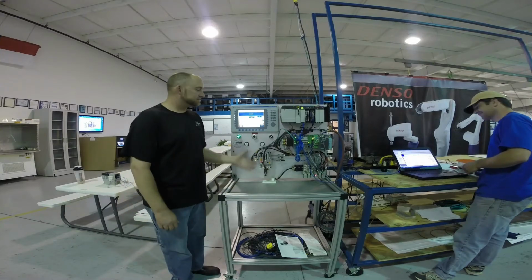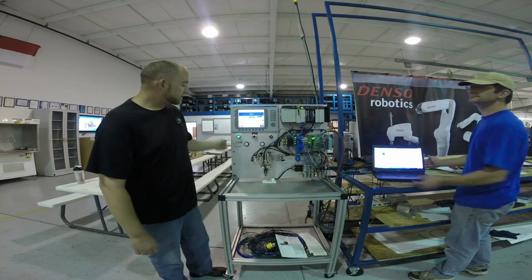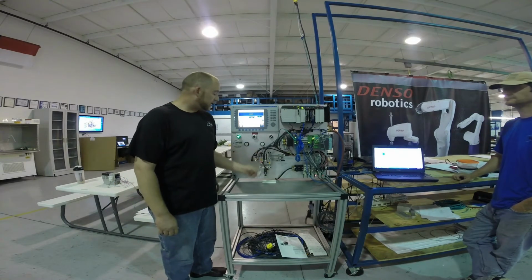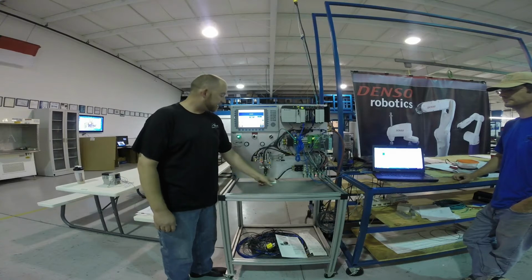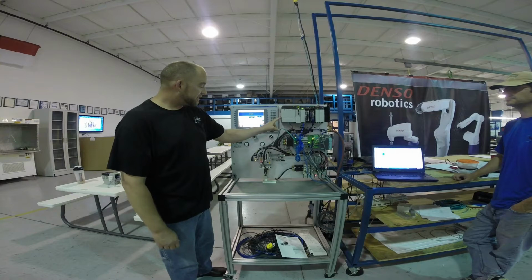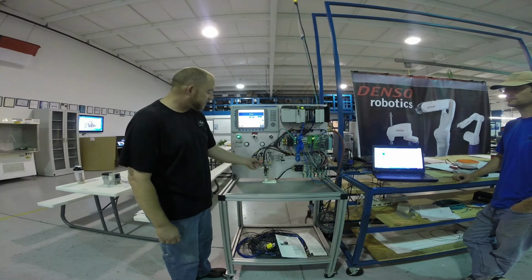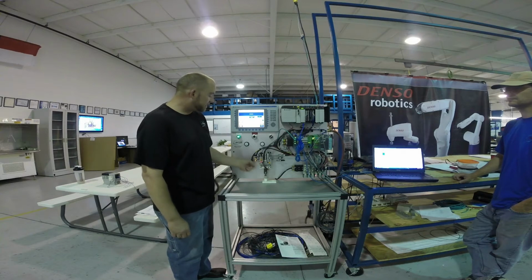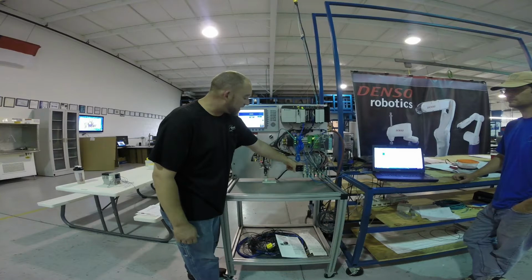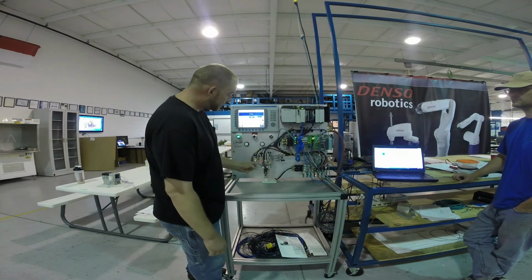This is a machine, PLC, HMI. There's a pick and place that can take this little puck and move it from here to here. This controls the sequence of operations. It is fed by input from the cylinder, so we know where the cylinder is in space. It's on here and it's up. It's controlled by valves that are air driven, and they control the motions, left to right, up and down, open and closing of the gripper.